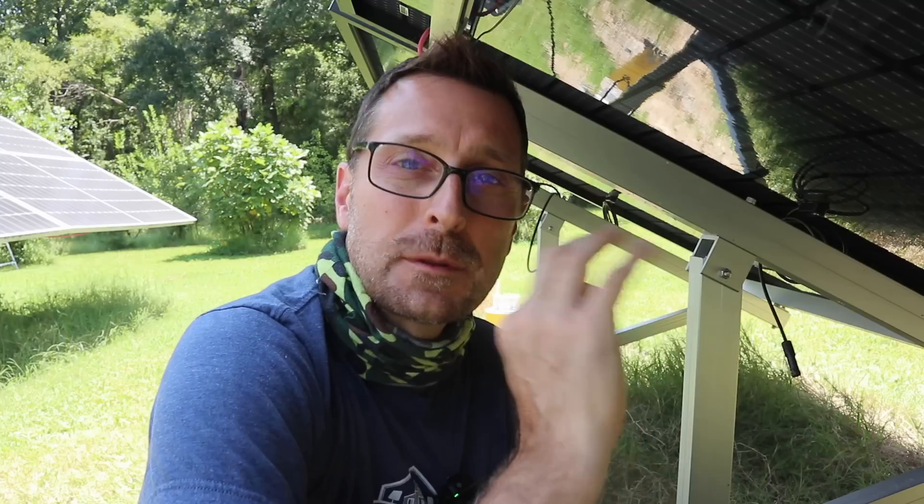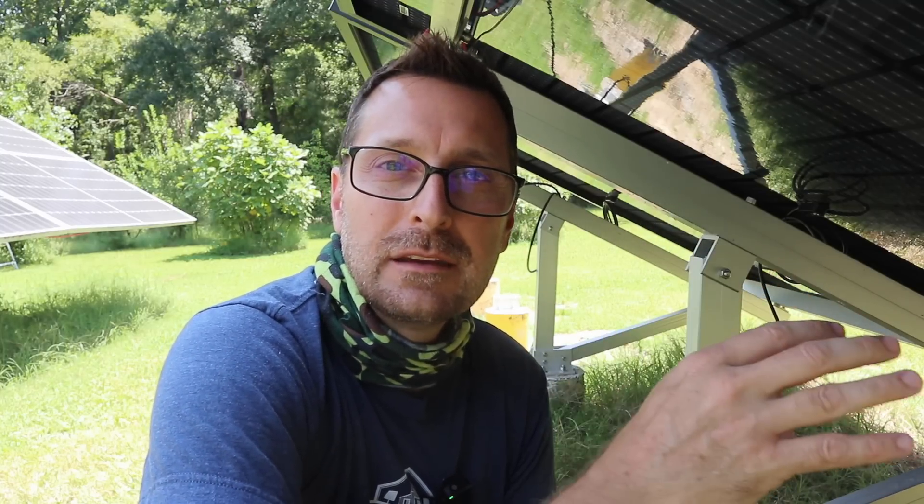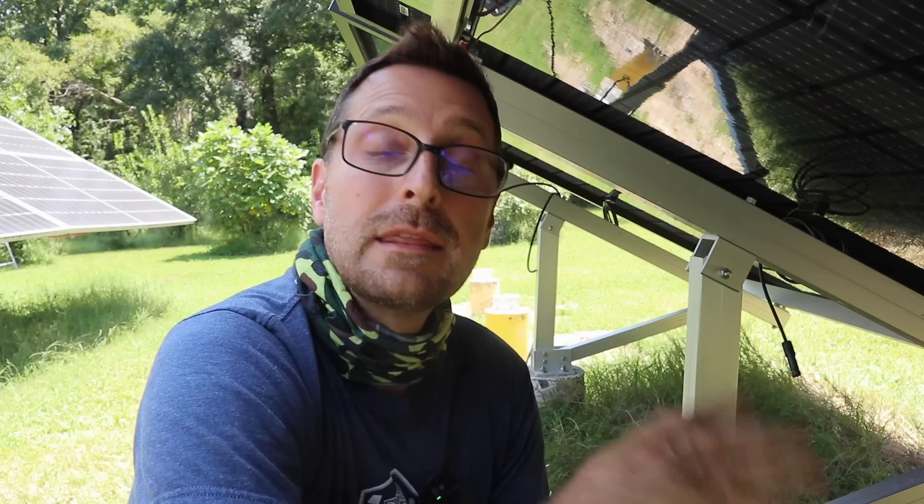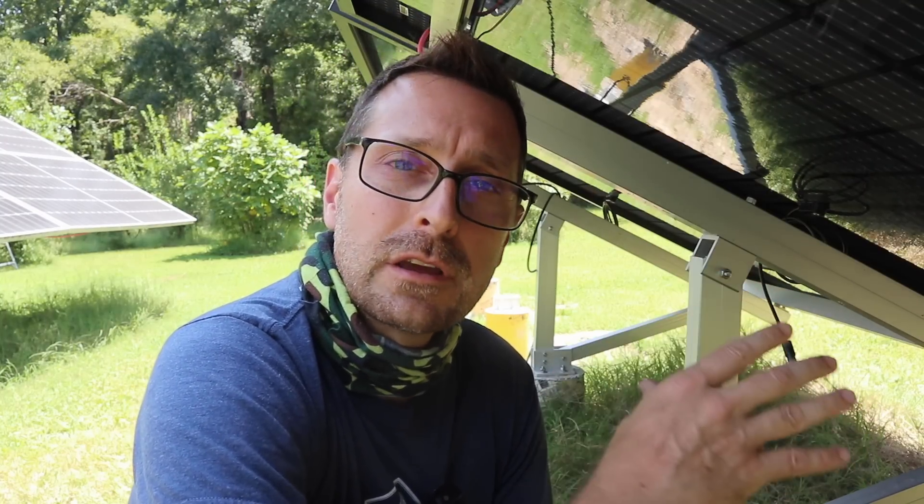One of the really cool things about these panels is that they have a lower voltage than most panels of the same size. Most similar panels are about 48 volts up to maybe 51 volts. That lower voltage is key to being able to run more of these panels in series into an inverter like mine - the EG4 6000 XP. The current on these is a little over 13 amps, about 30% higher than panels of similar size. Just think about those numbers when you are configuring your strings for your specific inverter.